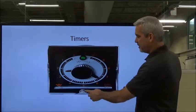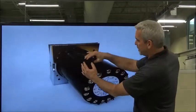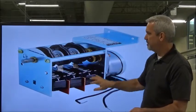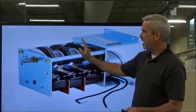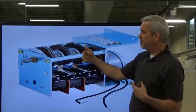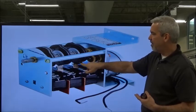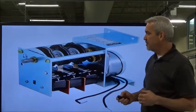Whenever you have to replace one of these, there's usually a blocking screw here. Give it a quarter turn or so and you can pull the whole unit out, housed inside this black casing. This shows you the mechanisms — it's got cam lobes mounted on the motor shaft, and you've got limit switches down here that these cams will roll over, driven by the motor while it's running. You've got three sets of switches, three sets of cams with lobes on them — those are what open and close the contacts.